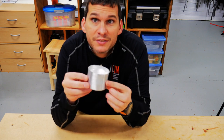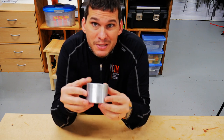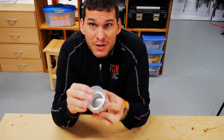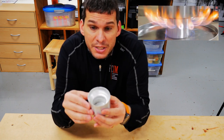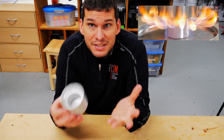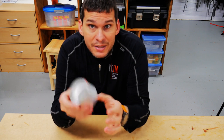This is by far the coolest stove I've ever made — the most professional one I've ever made. It came out amazing and I'm so happy with the way it looks, but the performance kind of stinks. The best looking one is definitely the least efficient. You can see it did get two cups of water to a boil, but it has two negatives: it burns very quickly, I think just because of the size of it, so it quickly burns away the fuel. Second, it does need fuel sprayed around the outside to preheat it, or else it takes over about a minute to preheat and actually bloom. Doing it this way took about 20 seconds. But overall, although it does work, it just runs out of fuel really fast.